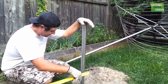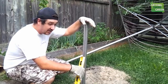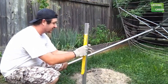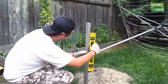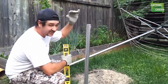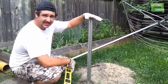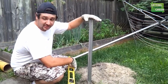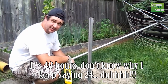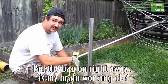We have officially filled our hole. Surprisingly it was only two bags — I would have thought we needed three. So we saved some money. Now that the hole is full, I am going to double check and make sure we are still level. This side we are, this side we are — it is very square, perfect. The concrete we are using takes 24 hours to fully cure. After 24 hours we are going to put a bag over top of this, which actually helps it cure even better.